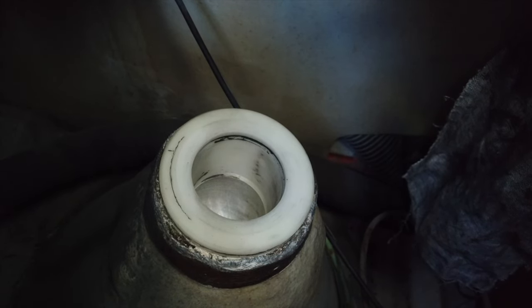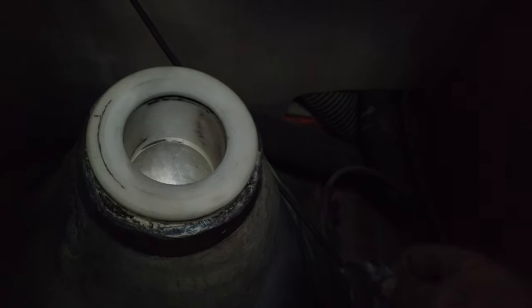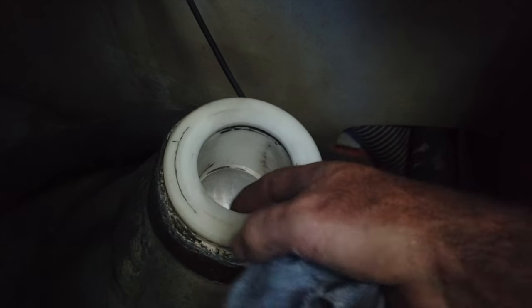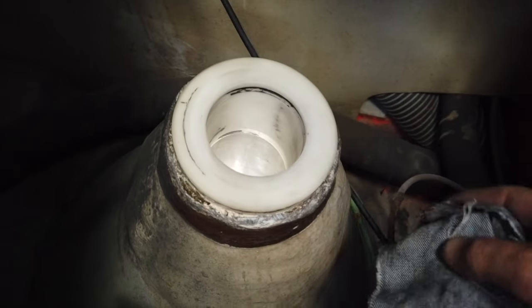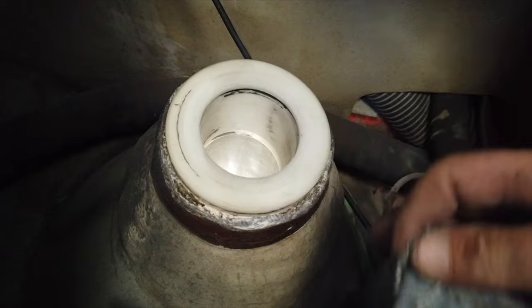The manufacturer did not want this thing to be removed easily anyway. The bearing appears to be in very good condition. It has an O-ring sealing surface that wasn't in the best shape, but I can easily replace the O-ring and restore that seal. I think what I'm going to do is put the rudder back in place and see if I have any play in it. I'll put the new O-ring in first and that'll give me a good idea of what condition it's in. If it's not in bad condition, I see no reason to replace it.